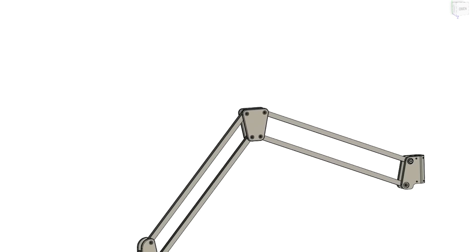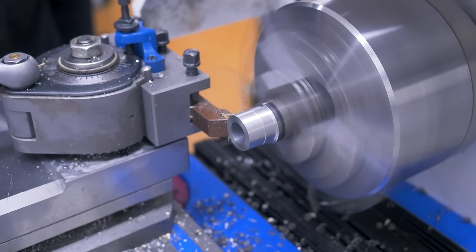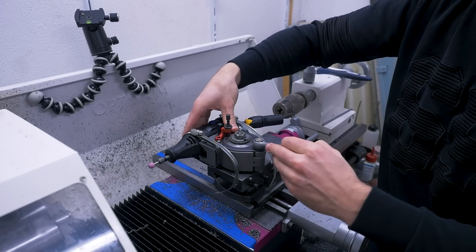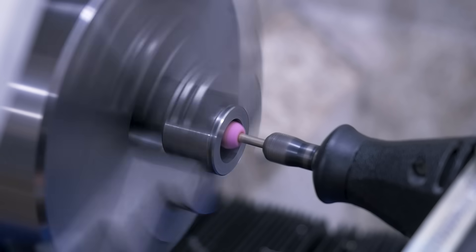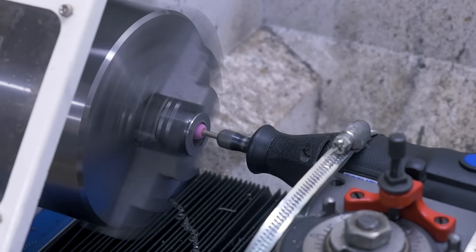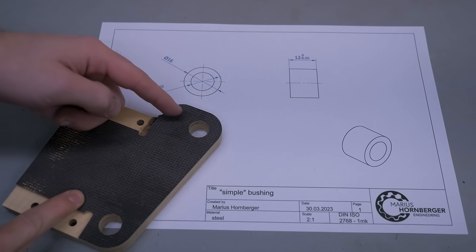So now comes the last assembly — the parallelogram arm, which is quite similar to before. I cut all the wooden parts on the CNC router, and then again need to turn steel bushings that precisely fit the second shaft. First turning the OD to a press fit in the wood, then cutting it off, and turning the ID to dimensions. However, this time I wanted to try something different: grinding the ID to size with a Dremel tool. For that to work, I needed to rotate the tool post by a couple of degrees, spin the lathe in reverse, scratch the surface, set a couple hundredths cutting depth, and here we go. I'm genuinely impressed how well this works — feeding all the way in and all the way out again. After three passes I got a slip fit with one one-hundredth play. I couldn't have asked for more. I pressed them in and continued with the remaining wooden parts.